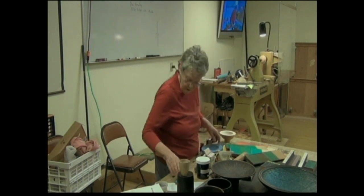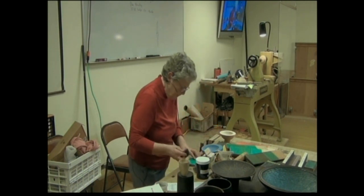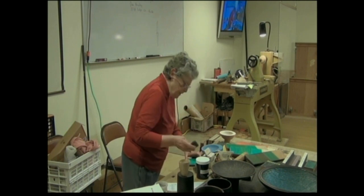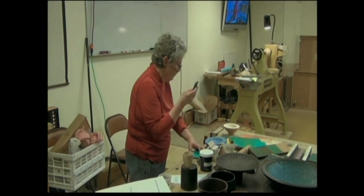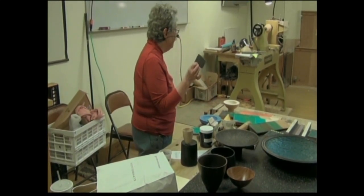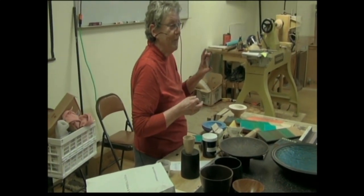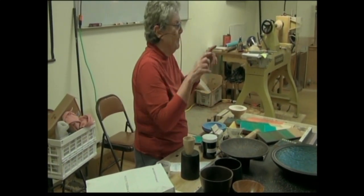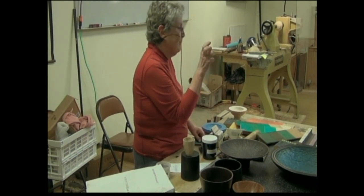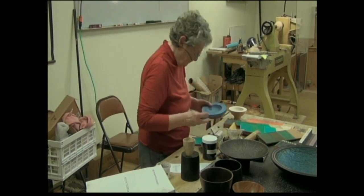I think I didn't rub this out enough. Let's see. These are fantastic to rub out milk paint. It's like a Scotch-Brite. I buy pads. And at Grainger, I found, because I was doing so much work, you can buy a roll of it 4 inches wide. I mean, it wasn't cheap, but it lasts forever.